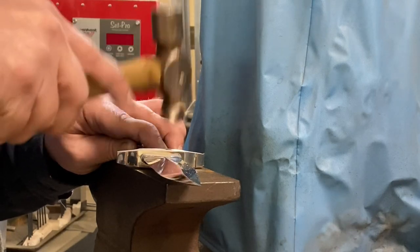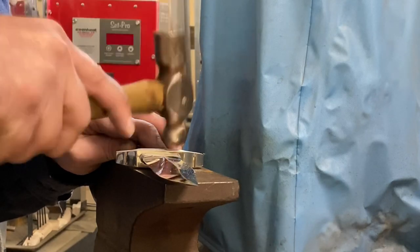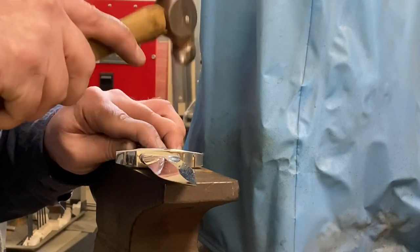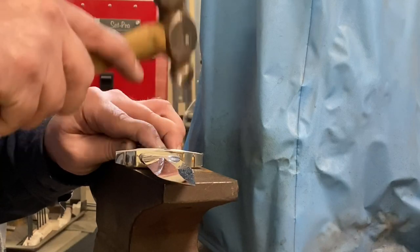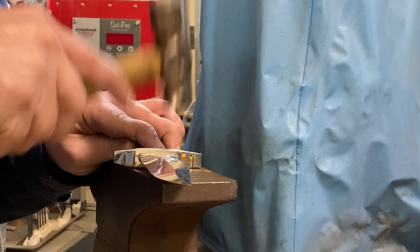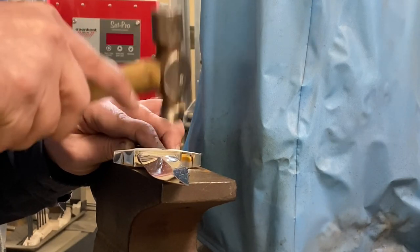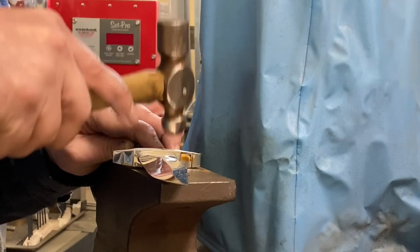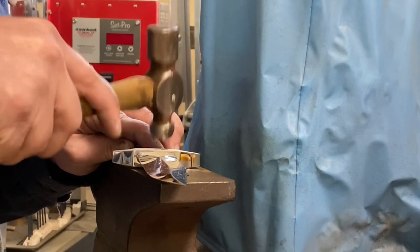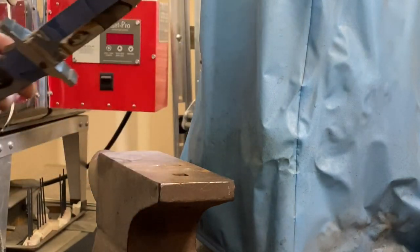Along those same lines, you wanna make sure that the anvil is only really touching the pin and that the knife isn't sitting on the anvil, or else you could mar your blade or deform your guard depending on what it is that is touching the anvil. Other than that, it's pretty much just tedious and loud, and well, your neighbors aren't gonna like you very much.